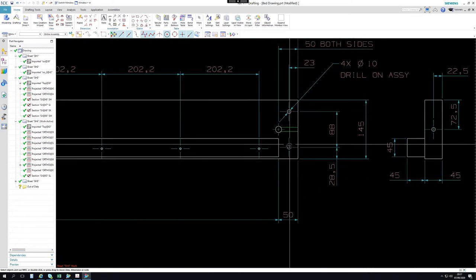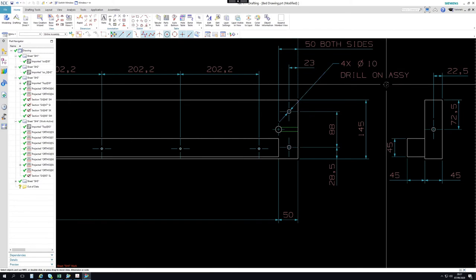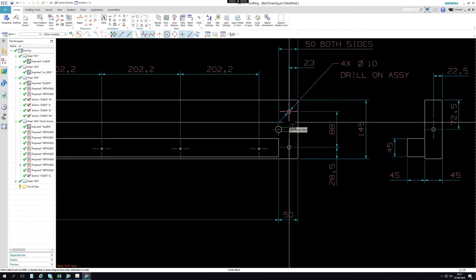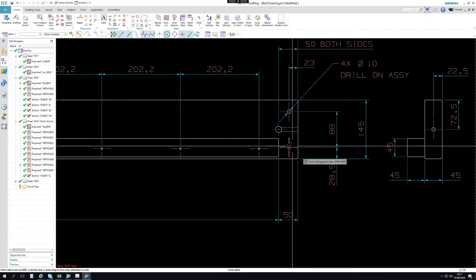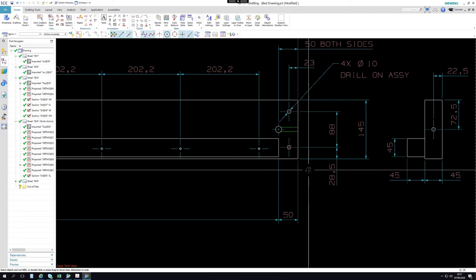We've got here these outer holes, I've said down to 10, drill on assembly. So what you'll do is you'll put the leg, this item to the leg, align the outer faces up, and then drill through the leg to make sure they all line up properly.